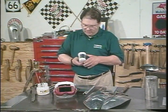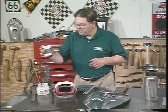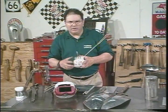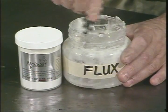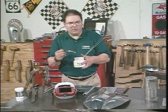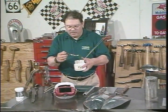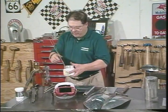The flux we use is Aladdin flux. It's a very good flux, it's not real expensive, and it comes in 4, 8, and 16-ounce sizes. I mix the flux in a plastic container — I can't have any metal in this container as it would contaminate the flux. I mix it with regular tap water to the consistency of pea soup, nice and thick, or it will run off the work. It helps sometimes to preheat the work and paint it on. Notice that even my brush has no metal on it — I've removed the metal ring that holds the bristles and replaced it with rubber shrink tube, making a metal-free brush.